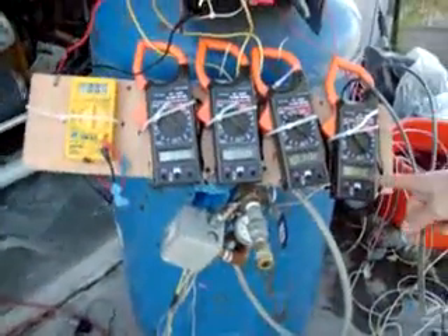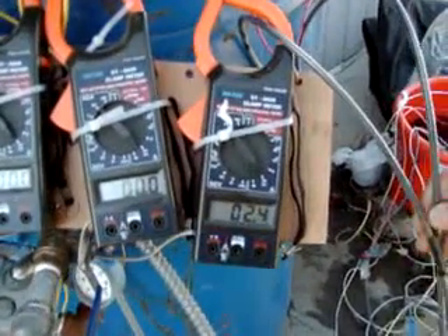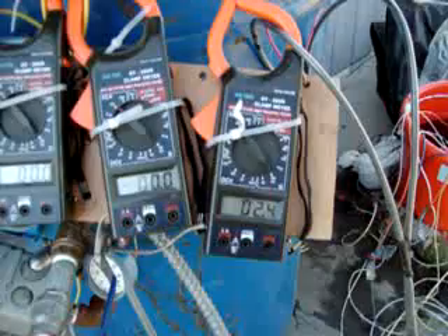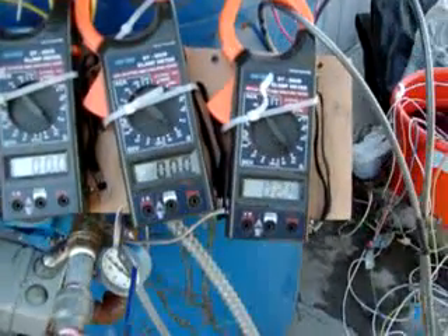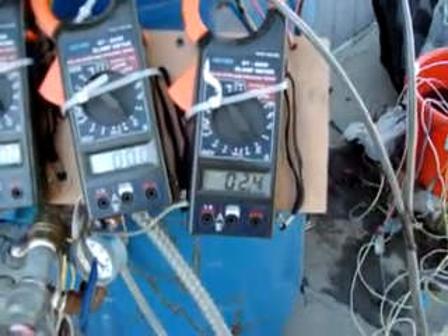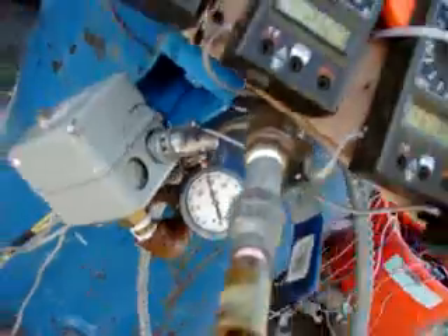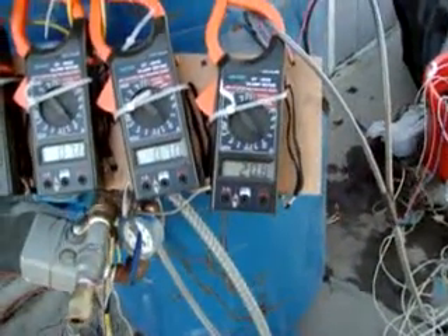So let's go up here and take a look at the meters. You can see this one — our transformer right now, this is our input, 240 input. We are drawing about 2.4 amps at idle, so the transformer is on now. If you want to, you can connect the switch and turn the transformer on and the motor starts automatically. Let's start this motor up — we have about 150 pounds in the tank right now. Start the motor up, the relay opens, takes out the start capacitors.